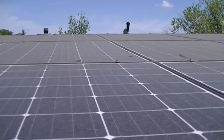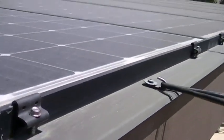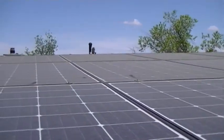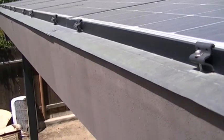Between the panels I have a shared system that bolts those panels together. This is what we call an end clamp, used all the way down the line on both sides. Then there are custom-made mid clamps in the middle. My customer went ahead and put wood fascia on the metal purlins to give it a custom look with trim and a wood appearance. He applied that to the metal fascia — it's called a C purlin on the ends here — and it looks really nice along with the brick work.